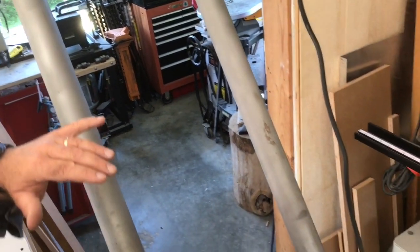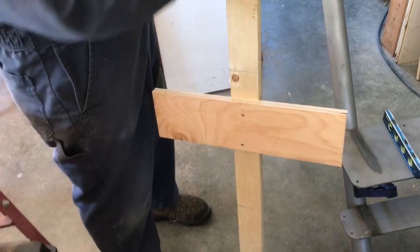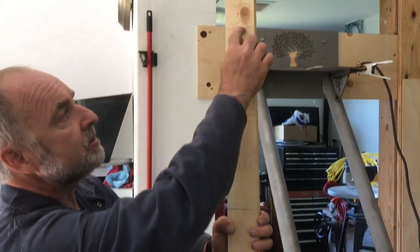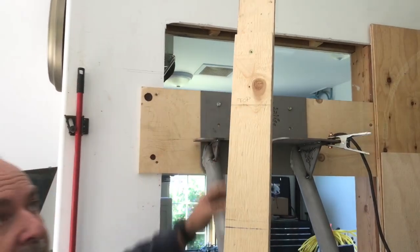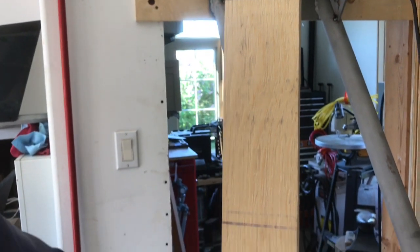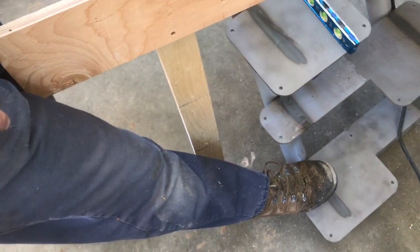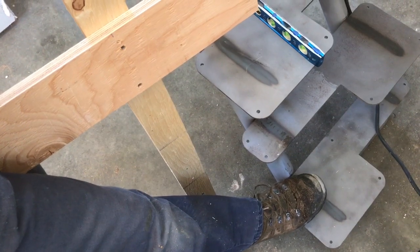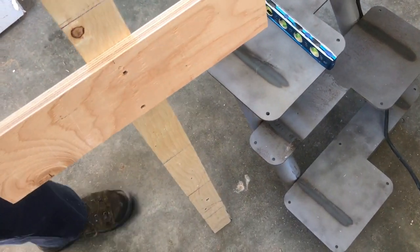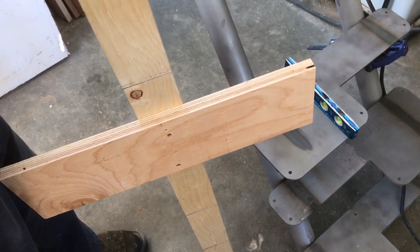Now I have a whole bunch of these metal tread sub-assemblies and we're welding them to the pipe. They have to be equally spaced, and that's where this story pole comes in. These pen marks are equidistant from each other all the way down, so that when you step on the bottom tread — with the inch-and-three-quarter cherry tread on top — you'll experience the correct rise of about seven inches and seven-sixteenths.